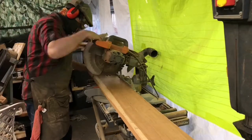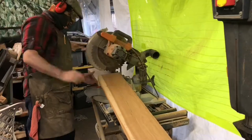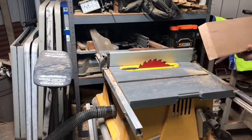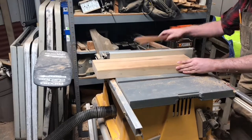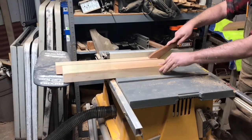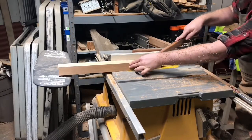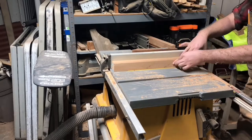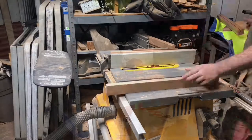The first thing I needed to do was to work on the columns. So I cut off a nice chunk of cherry and headed over to the table saw to rip it. I need these to be square so I used the thickness of the wood to set my fence and rip off some square pieces. Then I cut out a rebate that was half the thickness of the piece from both sides, so it could look like the column was wrapped around the corner. At this time I didn't have my lathe yet.